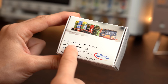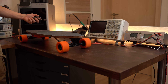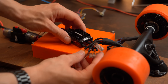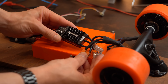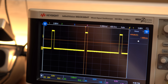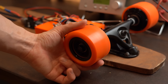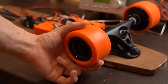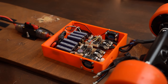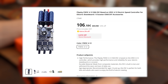This board is a BLDC motor control shield for the Arduino. I got interested in it because when controlling BLDC motors, you frequently have to settle for a generic electronic speed controller. They work fine most of the time, but all you can basically input is a servo signal which dictates how much power goes into the motor and how fast it spins. The RPM is not constant when a load gets attached, you cannot reverse or fine-adjust safety parameters. If you want those features, the most popular option is a VESC, which works beautifully but is kind of pricey.